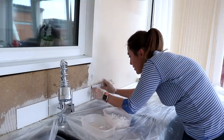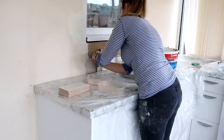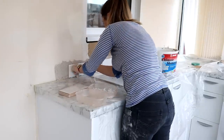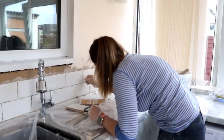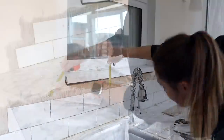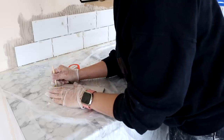I just kept going on my first main row and then occasionally I'd make sure everything was level. The other issue I had was the wall wasn't totally flat because the wooden area stuck out a little bit, and to work around it I just built it up with a bit more adhesive. Because I'm going to be adding a trim around this, I purposely didn't cut my last piece until I was ready, so I'd go back to the centre and got the majority of the work done. With any kitchen you've got to work with what you've got — this windowsill was one of those examples because it doesn't stick out enough for my liking, so I decided to cut the tiles up to the edge and silicone seal over it or build out a lip.